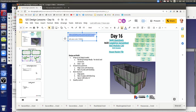And in the workshop, what we want to do, you can wrap your head around it, we went through the house wrap and the exterior panels for most of the regular modules. We can continue that. There's a bunch of modules that we can do that way. They're not windows or doors. For windows or doors, you've got to do the cutout for the windows, obviously, but because we don't want to throw out half a sheet when we cut out a window, we can do strips. So the thin sides on the side are a strip, and the top and bottom are strips. So we're using mostly 100% of the material, as opposed to wasting 50% for those panels. But for now we can continue on many of the ones that are the same, both the 8-footers and 9-footers.